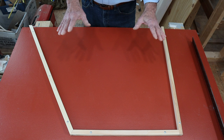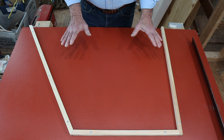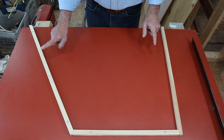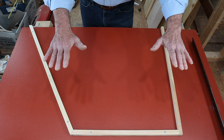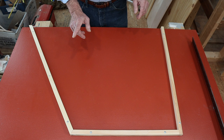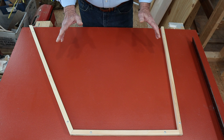So right here I have a hypothetical shape for purposes of demonstration. What I'm going to do is make a transferable file folder paper pattern. Making a paper pattern is so much easier than trying to measure and get something to fit. I had a job once — a kitchen remodeling job — where the customer wanted a bay window in front of the sink, and they wanted the countertop to run right out into the bay at one level. That was a tough piece of laminate to cut, but I did it with this idea, and it wasn't that hard.